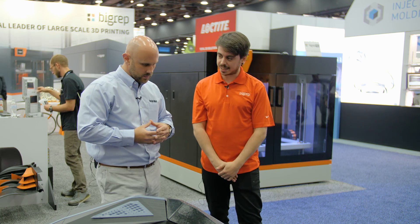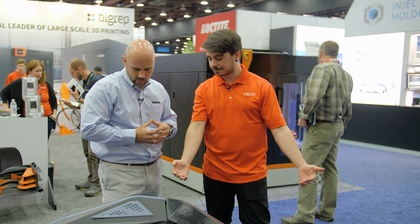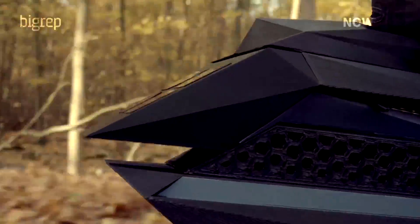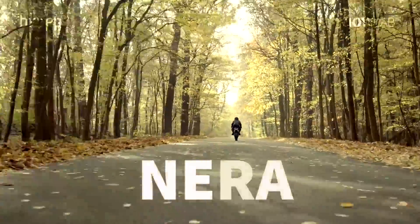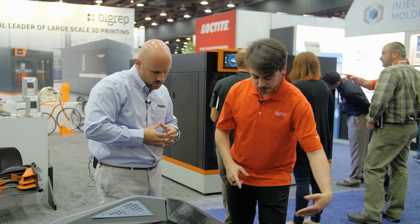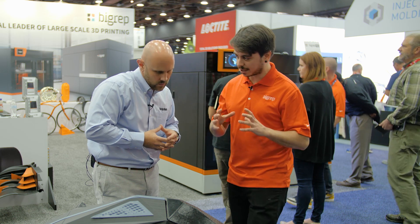Another innovation is the airless tires. We already developed airless tires for bicycles, and we wanted to push further. We have two different airless tires to show how much you can customize them. The front one has an arch structure — all arches — while the back one is more hexagonal. The front tire absorbs more impact because we don't have suspension on the front; the back one is more rigid, which is fine because we have the bumper, and also because the motor is inside the back wheel — so rigidity helps keep the motor stable and structured.